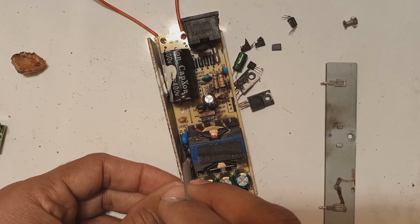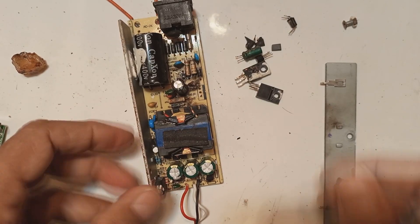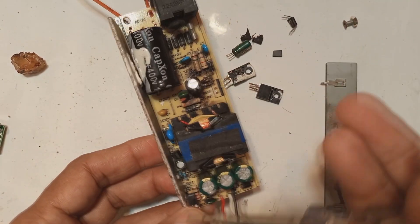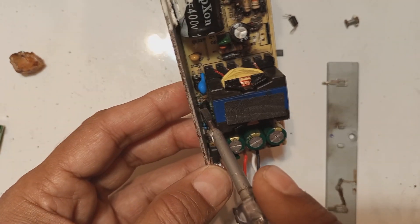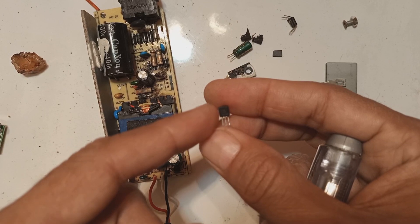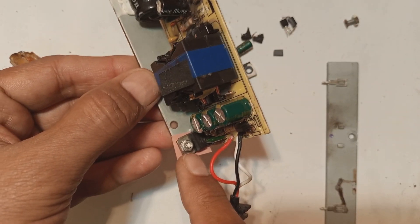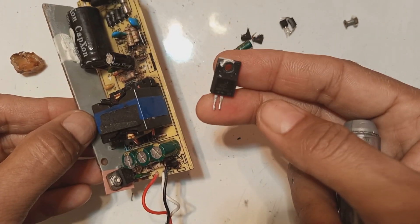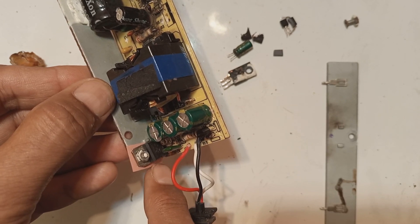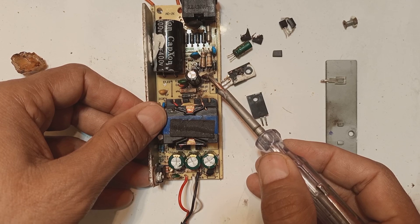I fixed a new MOSFET sourced from another board over here. The optocoupler — also called optoisolator — and the TL431, which is a programmable reference zener, a 3-pin IC like a transistor, is located here giving reference to the optoisolator. I replaced it as it was likely blown. The output stage two-diode rectifier — a three-leg diode — was also short circuited. I replaced it with a metal tab type, insulated with an insulating washer. Some other resistors and diodes had also blown and were replaced.